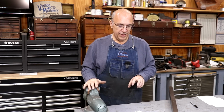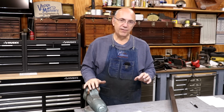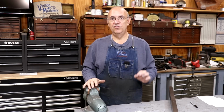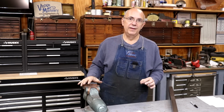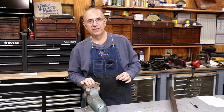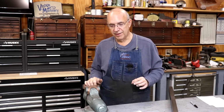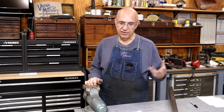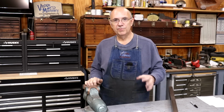It broke. And anyway, long story short, we made a repair to the spring hanger that's out there. But it's a temporary fix, and we want to make a new spring hanger so that we don't have to worry about whether my braze job, holding this thing together, holding up the boiler on this locomotive, is going to hold up indefinitely. I actually think it will probably hold up for quite a while. Brazing is a good option for that kind of repair, particularly this particular spring hanger.